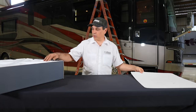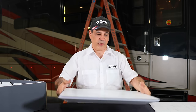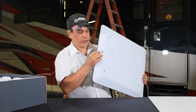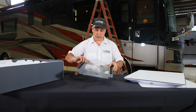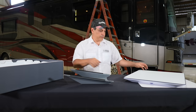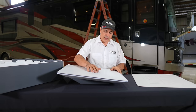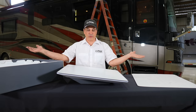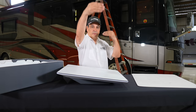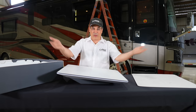I want to talk a little bit about why this thing is tilted. Here is the high performance unit — obviously it's much bigger than the Gen 2 or Gen 3, and especially bigger than the mobile unit. It's much heavier but it has this one sealed area for the cable. The mount is tilted because this is going to get mounted on the front of the coach pointing slightly forward. The nice thing about these high performance units is you get 45 degrees more on each side — extra viewing — compared to the normal one.